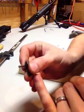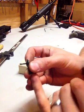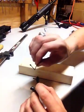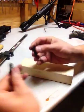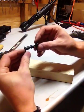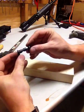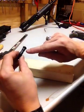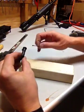If you can see that there, and I know this is really small, so I'm going to try to get it in there. There's a little detent right there, a little notch. When you put it together, you're supposed to use this little tiny 1/16 inch Allen wrench and a little tiny set screw. So you slide your main safety selector from the left side. You're going to put your detent in, and follow along with the next video if you want to see how I do that. Once that detent is in, you should be able to slide this together, and from the inside of your lower receiver, put in that little screw right here, and that's going to lock it in place.